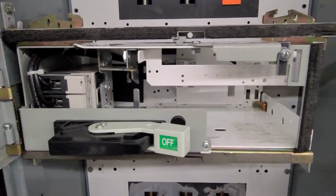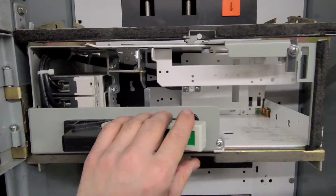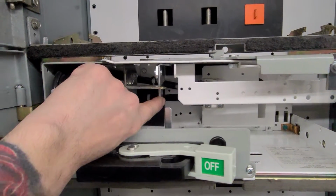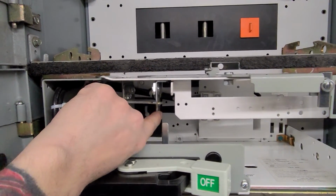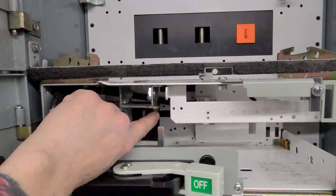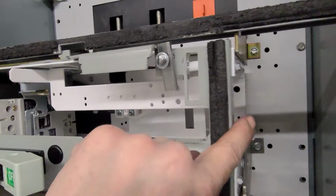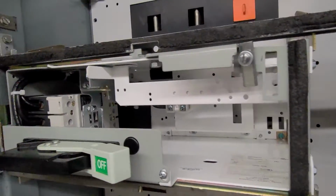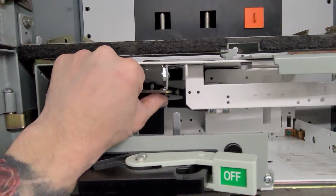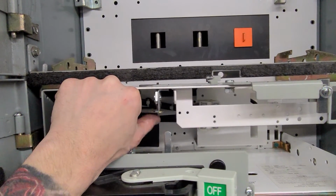Then doing that, we had noticed at one point, if this thing wasn't quite all the way in correctly, the little cell interlock was, you can see it popping through, actually clipping the front channel on the back side. So with a little bit of adjustment to the frame, tightening up the unit, making it a little bit more compact, by loosening these screws here in the frame and kind of sandwiching everything together, we're able to tighten that up a little bit and get much better motion. There's no force on that, it's free and all that good stuff.